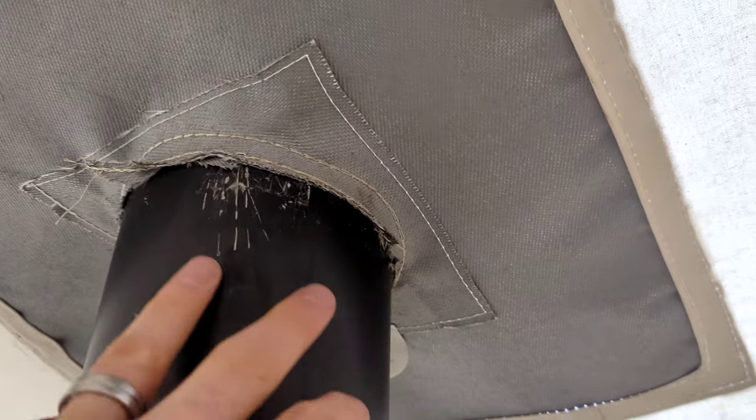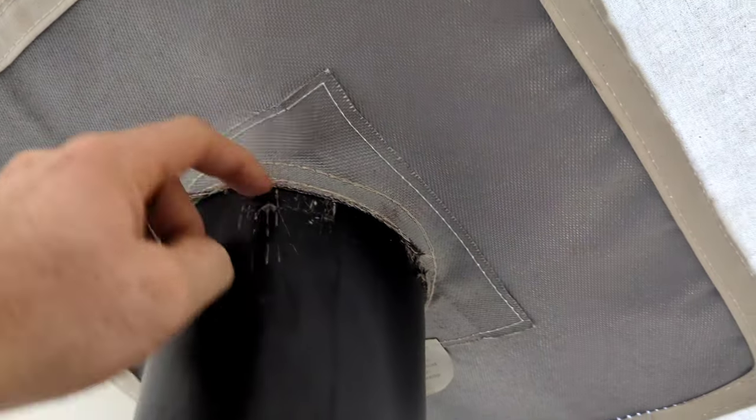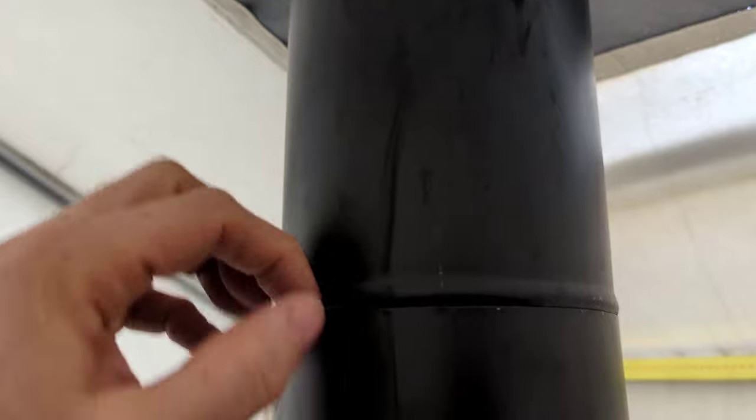I think I know what the fix is. Because I had the cap on top and didn't want to push it through, I brought the pipe down from the outside in — this is six-inch pipe. In doing that, this fabric got pushed down. We have a rain fly over the top and there's a little opening where the fire-resistant fabric is installed. I think because the pipe goes down that way, we're getting some capillary action — the water comes down and can get inside the stove pipe at the seam.